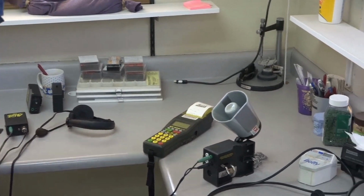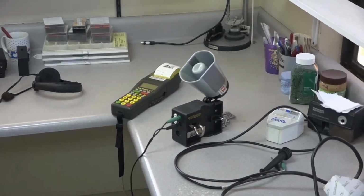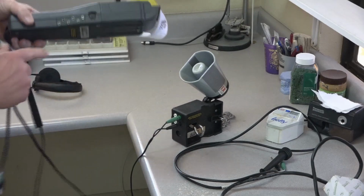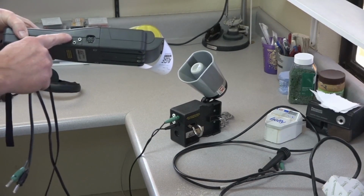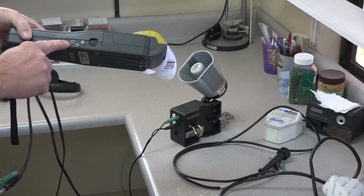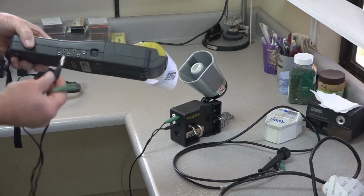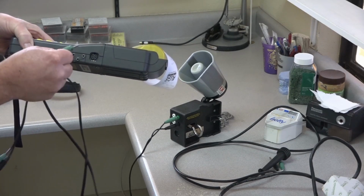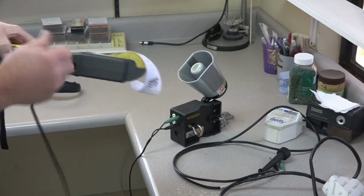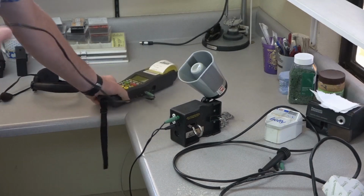Okay. Next cable. You're going to connect into the C0 that says D output, C0, that C means channel, and channel 1. So it's very important that the polarity, black is on the bottom always. If you turn it around, this will beep constantly, so that would be your trouble.